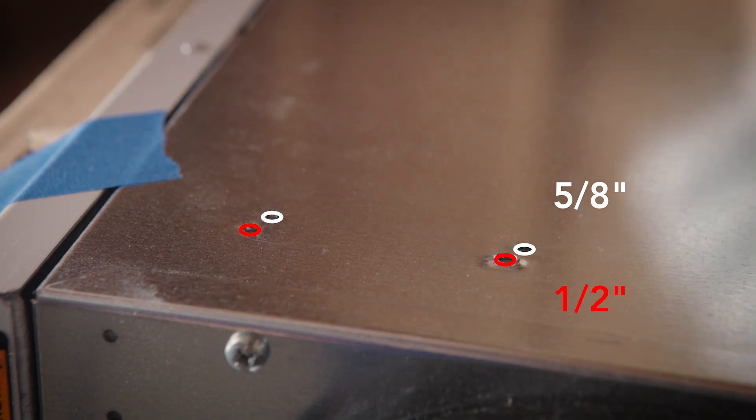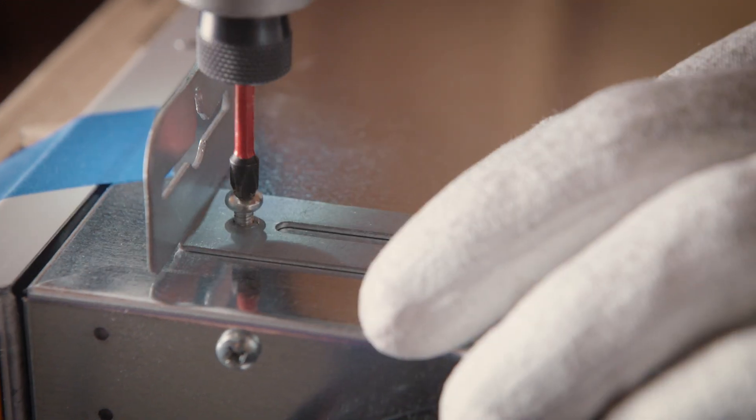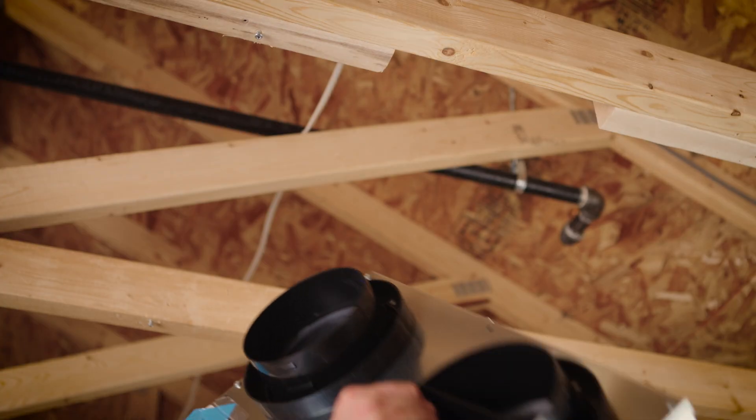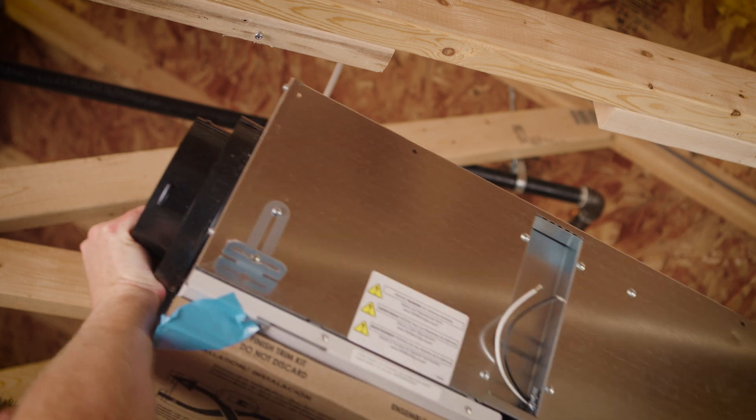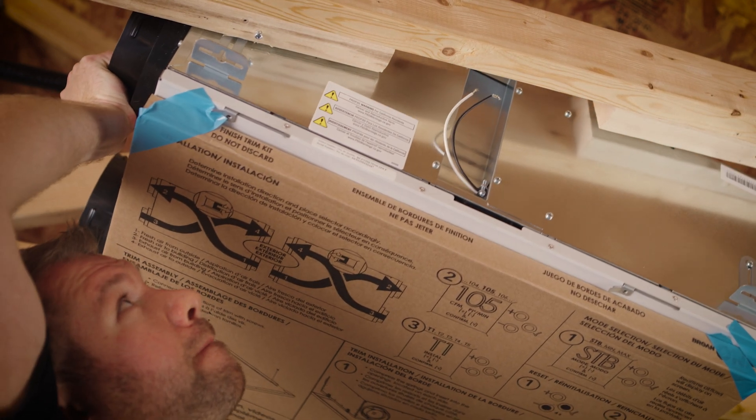Based on the ceiling or wall material thickness, install the four mounting brackets with the provided hardware into the respective set of mounting holes. With the mounting brackets fully secured to the unit's housing, carefully lift the unit and fully place the unit onto the pre-installed mounting screws.